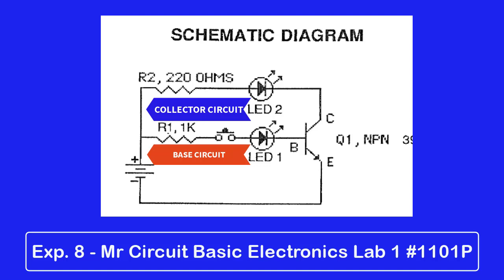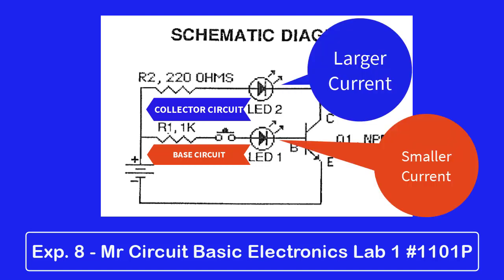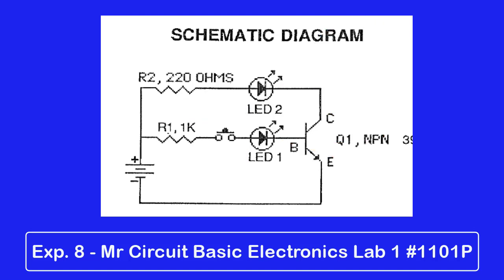But you will notice that LED 1 in the base circuit is a little less bright than LED 2 in the collector circuit. What this demonstrates is that a smaller current in the base circuit is causing a larger current to flow in the collector circuit. We refer to this as amplification.